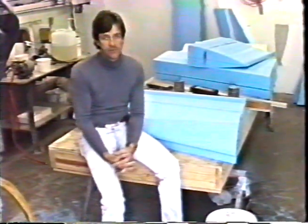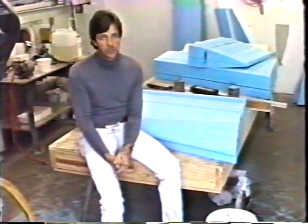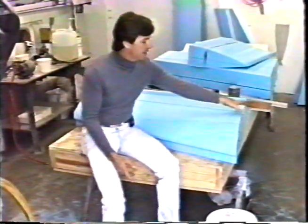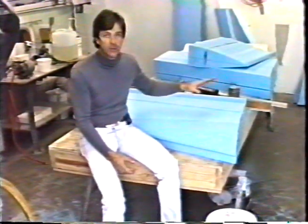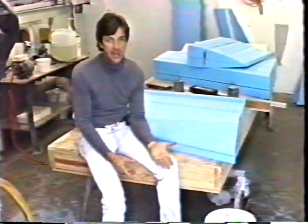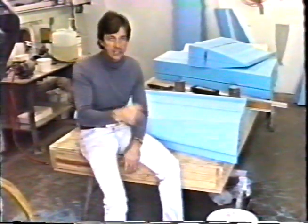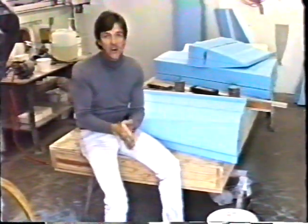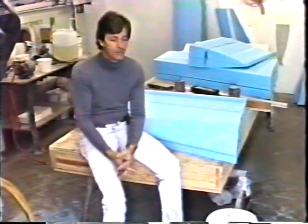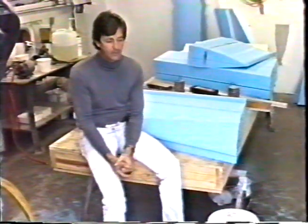If they are not, we would encourage you to sand the crowned surface, the high side, first, and place weights on the opposite ends, and then carefully sand down, without using too much pressure, the midsection first. Then when you flip your wing cores for the opposite side, weight them very heavily into the other side of the core so that they are held in the straight condition, because you will have generated a straight side on the side you sanded. When you finish the opposite side, you'll have taken all the tension out of the cores and you'll have them dead straight.